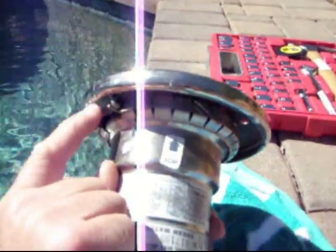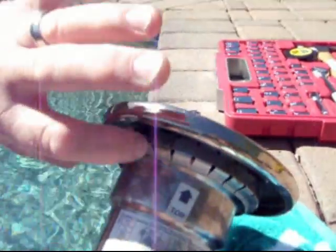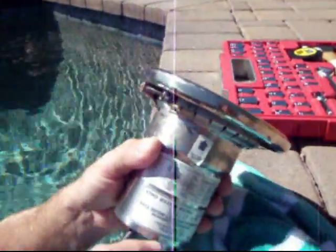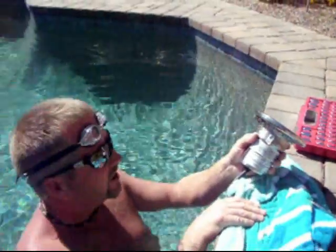And another thing that'll save you some time is make sure that you get this screw that holds the housing all together and pinches the rubber gasket together with the outside bezel to form that watertight seal. Make sure it's off to the side, because otherwise if that screw was up top here, you're going to have trouble getting your housing screw back in. So you tighten that screw and we're ready to reinstall the fixture housing inside the main housing.